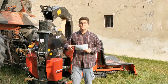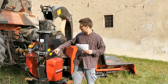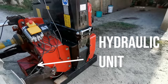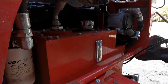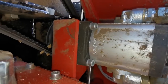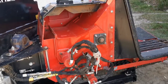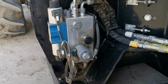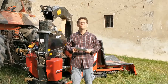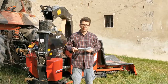The next group to analyze is the independent hydraulic unit located at the bottom. The first main element is the oil tank. Together with the pump, they guarantee the correct oil flow and pressure to all hydraulic services in the machine — like the valve group, the motors, and also the feeding rollers.